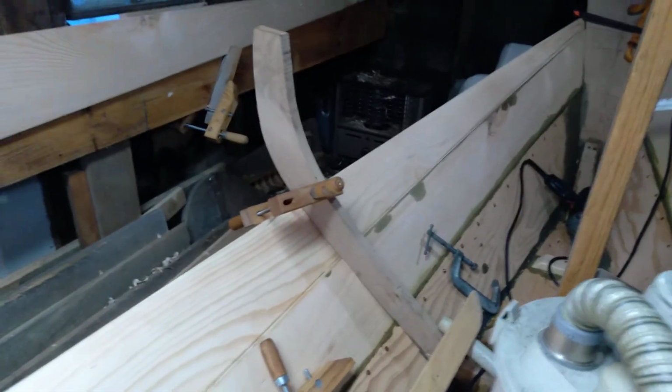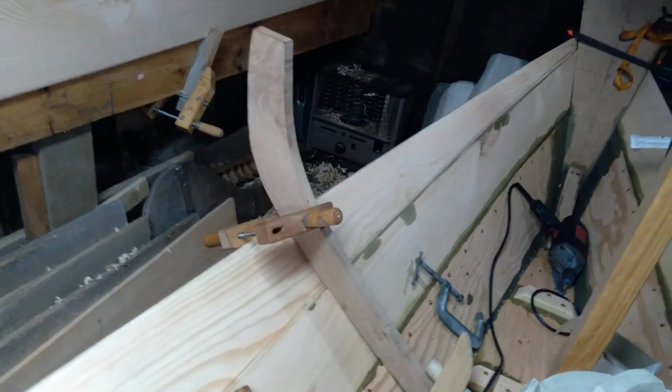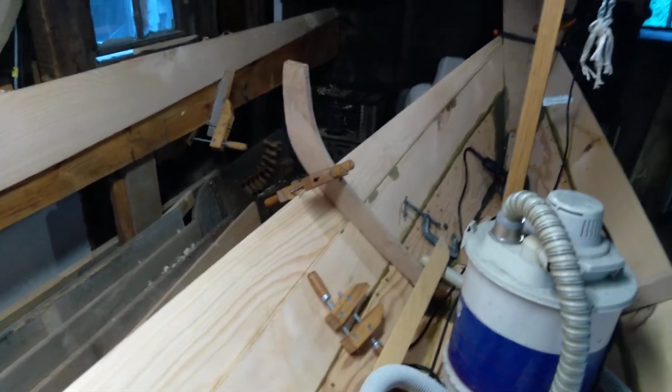Then you're starting to get a look at the run of the stern, and you can see what a straight run it has back to the transom, which eliminates the tuck, where the planks tuck into the transom. On shorter or beamier, chunkier dories, that tuck will slow the boat down at higher speeds, because as the planks swoop in, the more shape they have, the more water they'll pull in with them. So you end up generating a larger hull wave with a chubbier boat. That's what that straight run does aft. It just allows the water to sluice off the transom.